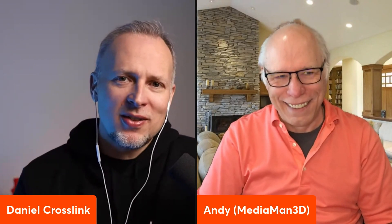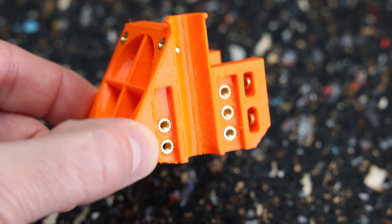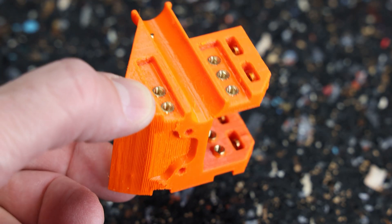Let's talk about what is new between HeroMe Gen 5 and Gen 6 — what are the main improvements made to the design? The major difference, number one, is that this example has got threaded heat press inserts throughout. That is a major design change, whereas in Gen 5, all the places where you can now screw in, you would have had to have captive nuts in place.